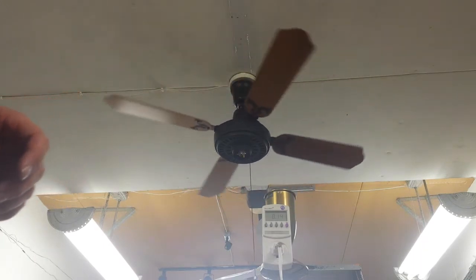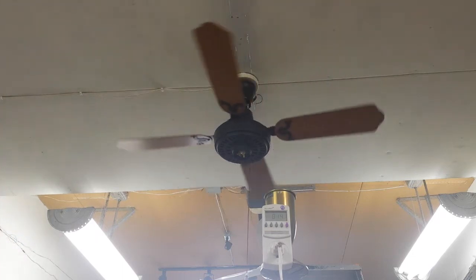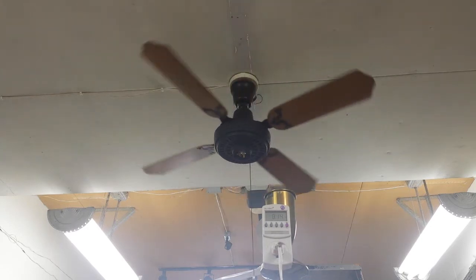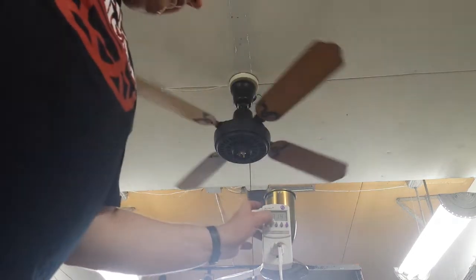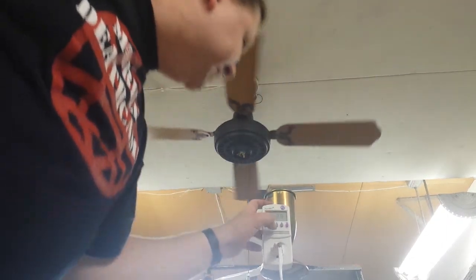Wow. Okay. So that's something that's really good to know. When you have a fan at solid state low, it's using even less electricity than you would think based on current draw because of power factor. I didn't even know you could have a power factor that low. I'm learning all the things. How many watts was that again? It was almost 3 watts.